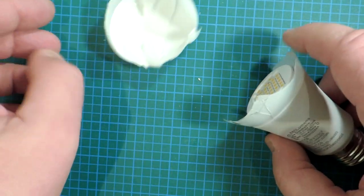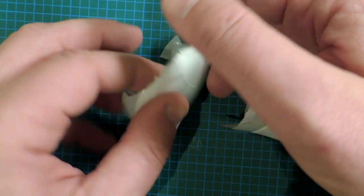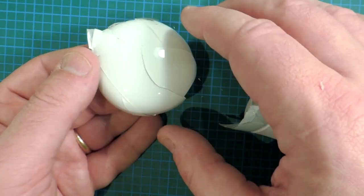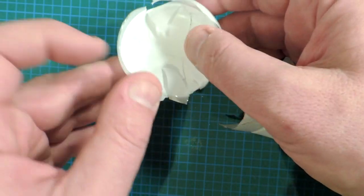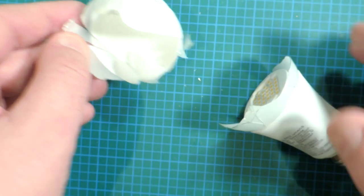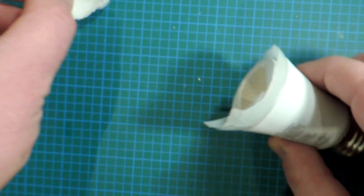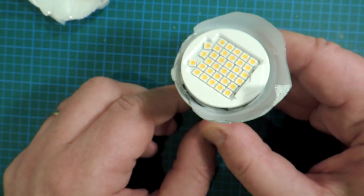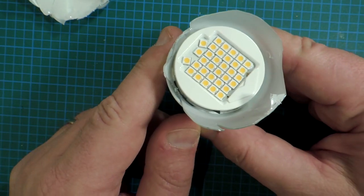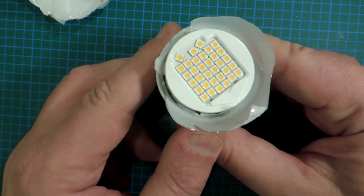Okay, top's come off, obviously. Same construction as the previous bulb. It has a glass envelope with a protective plastic coating so it doesn't shatter too badly if it breaks, and of course a selective coating of whiteness to, I presume, regulate the light appropriately. Unlike the one in the fall of 2013 I tore down, which had a remote phosphor, this one you can see the yellow phosphor has been placed directly on the LED dies.